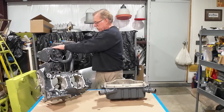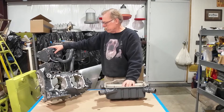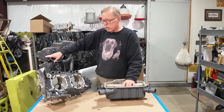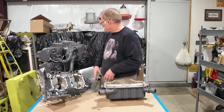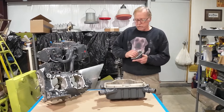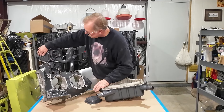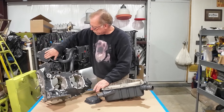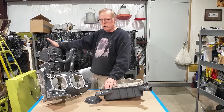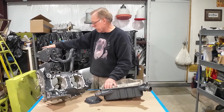The cylinders on your narrow deck or carbureted engines are going to be parallel valve, and you can tell those because they've got the standard valve cover shape. When you see a different-shaped valve cover like this one, this is an angle valve — more horsepower, more heat, better efficiency. That's your angle valve engine.